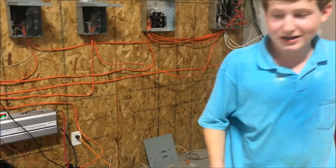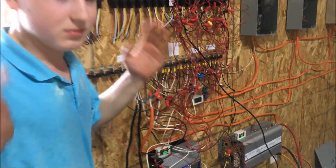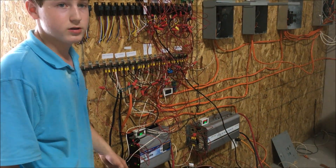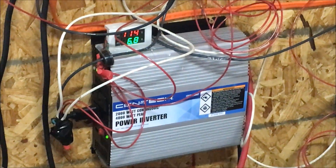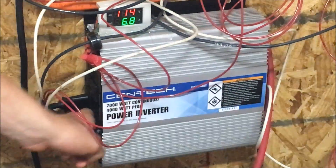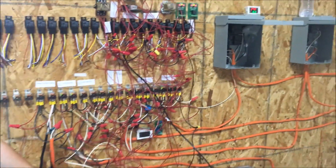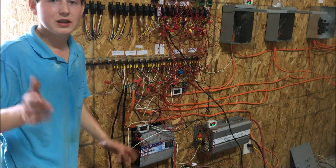Let me demonstrate that isolation right now. The lights are running and we're drawing 6.8 amps. To simulate a high-amperage condition where the inverter would alarm and shut down, I'll just turn the switch off. The inverter goes to zero — you'll see it on the meter go blank — and the control relay sends the message to the power control relays to turn on the grid. Over there on the grid meter the amperage should go up to about 6.8 amps. And off — that quick, we're up to 6.3 amps. The ventilation fans in the back also went off when I shut it down.